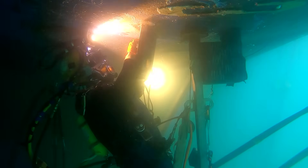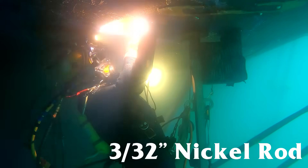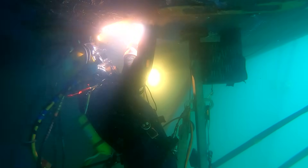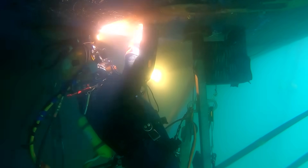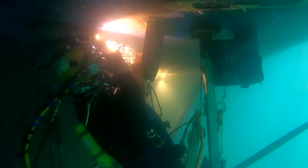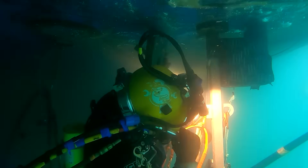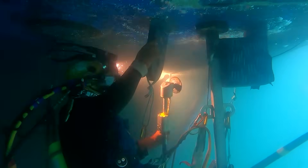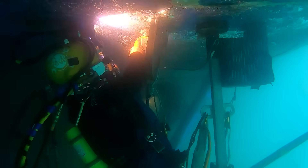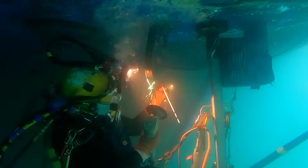The type of rod I'll be using at this particular moment is a 3/32 nickel rod. It's for high-carbon steels — anything 0.40 carbon and above is what we'll use these nickel rods on. We use them when we don't really know the exact carbon content, or when we know it's a high-carbon steel such as HY-80, HSLA-80, or HSLA-100. With regular mild steel rods they're really susceptible to hydrogen-induced cracking; these nickel rods, not so much — that's another reason we use them.